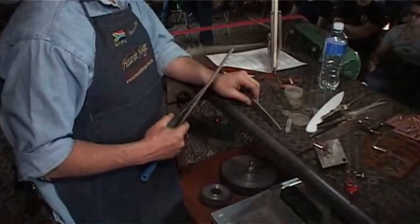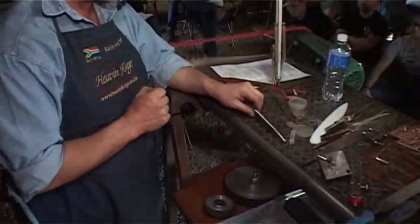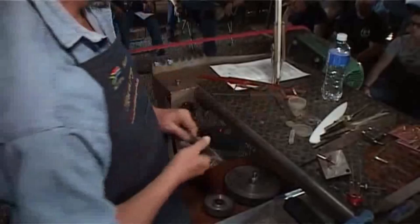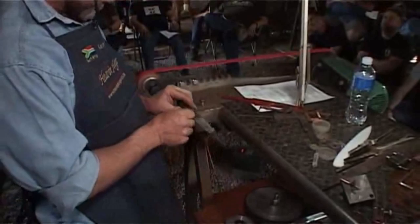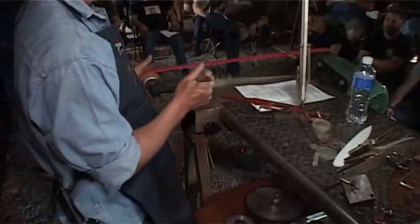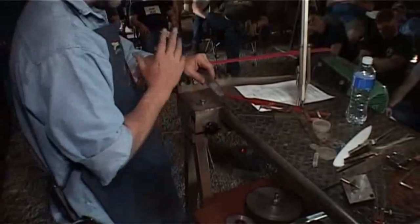Handwork will do things slowly and more accurately, with a lot more control than a machine running at hundreds of feet per second. And, I don't know, what is the typical belt speed? 60 something feet per second. All right, now I'm going to just make a little plunge on every start position and run a bevel down my cutting edges just to break the corner. Some guys who like to just do these little pre-grinds will then heat treat the knife and grind everything else afterwards. That's also fine. I'm going to just get used to this machine to start with as well.